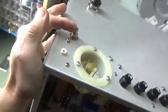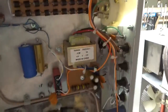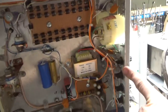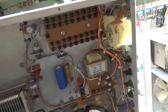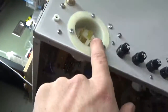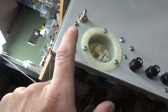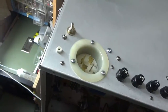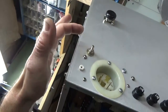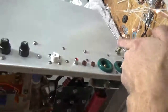This is the ground stud. I'm all about safety. It has reverse-connected diodes between the B-negative and the chassis, and the RF deck, and in the power supply section, which I'm getting ready to make. This twist-lock plug also has a ground. This is the cathode return. The B-negative goes through one of these connections, and the other two are 240V. I'll have a braided strap going to bond this cabinet to the bottom cabinet.